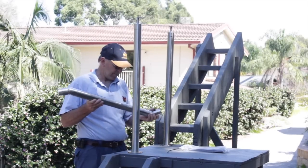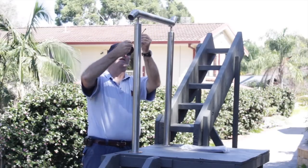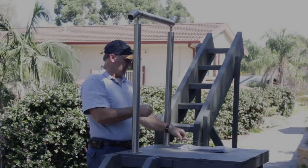Attach the adjustable elbows to both ends of the tube and sit it on the landing posts. To help hold the adjustable elbows in position and onto the fixed post saddles, I find it handy to use 300 millimeter electrical cable ties.